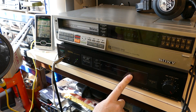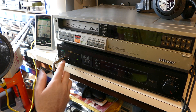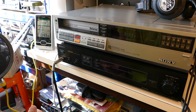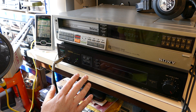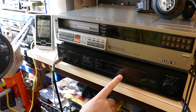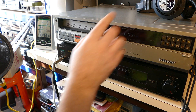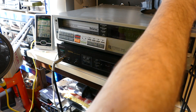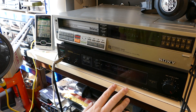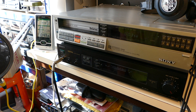We can see a nice strong tracking signal. The OVC control is green — it will occasionally flash, that's normal, but generally it's very good. That's the meters operating in normal VU mode. It all works beautifully. Emphasis is on this recording, so using headphones I have analog de-emphasis. But if I was connecting this to a digital recorder, I would do the de-emphasis in the digital domain.